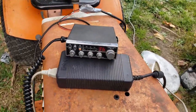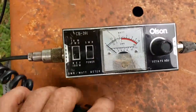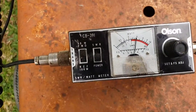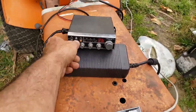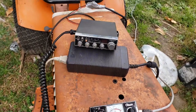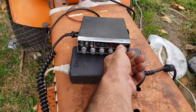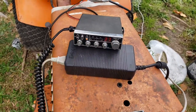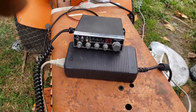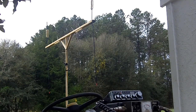It's just a 4-watt AM radio. I'll put it on the 10-watt scale and key up the mic — just under 4 watts on dead key. I'm going to talk to my buddy six and seven eighths, Andre. He is five and a half to six miles away in a straight line. As soon as he gets home and gets on his radio on channel 37 AM, we'll test it out and see how it does. And how about that — it's working! I can hear you from six miles away on this little homemade setup.